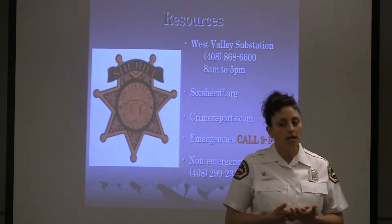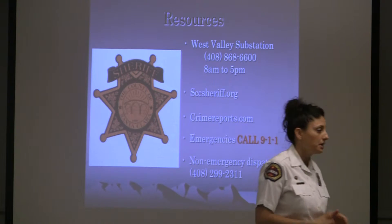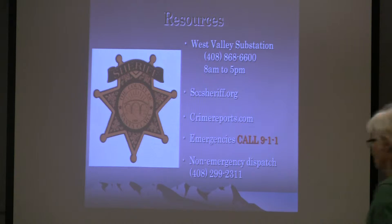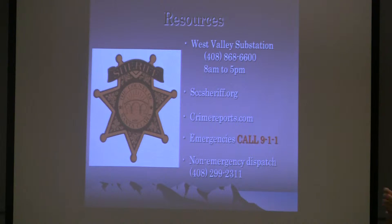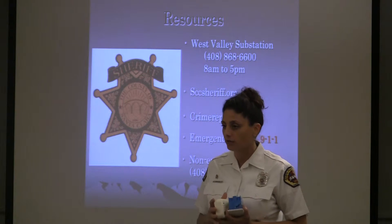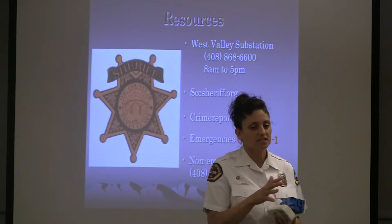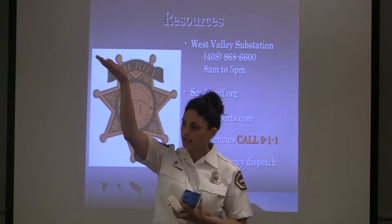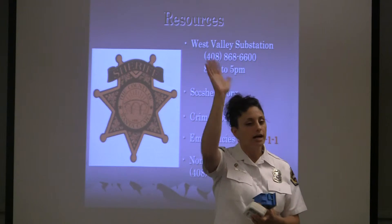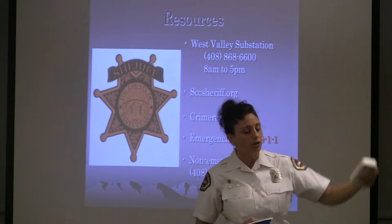Beyond that you lose all consciousness — we'll find people right near the door; they knew they had to get there but couldn't go any further and then they collapse. Carbon monoxide poisoning is a serious thing. A new law started in 2011, and in January 2013 it expanded from single-family homes to every single living residence — multi-family and single-family. Carbon monoxide is about the same weight as air, so unlike smoke it won't rise or fall — it mingles with air.